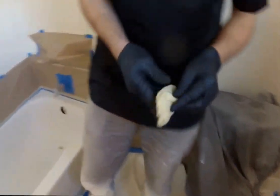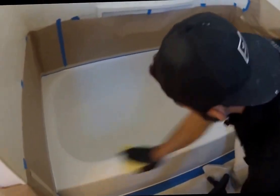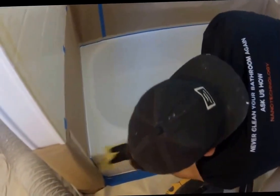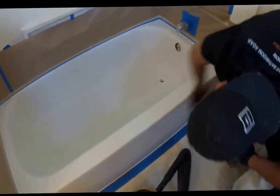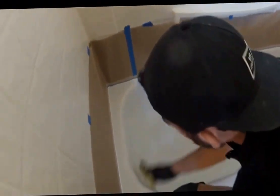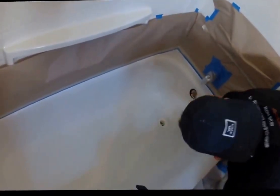Like I said, this here is a tack cloth. This is used by professional painters, woodworkers, and things of that nature. Before they finish a product, they go ahead and tack it. And like I said, it's almost like a manual vacuum cleaner, kind of assuring that any leftover residue, any dust or particles that might have fallen in there during the cleaning process and or prepping process will be completely picked up. So this is kind of our last chance to make sure we completely eliminate the surface of any dirt. Even bugs that might have fallen in during the acid wash, sometimes bugs will fall in there and die and stick to the surface, so this will make sure we remove all of it. This is our tack cloth process.